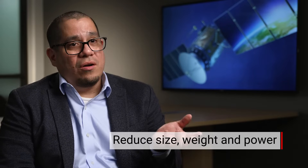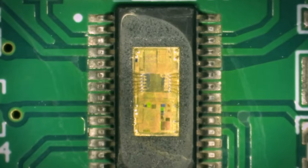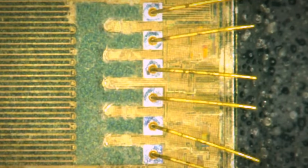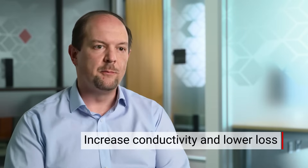Imagine you have your radiation-hardened die, which needs to withstand radiation effects in space, and now you're putting it through a very high reliability flow, but in plastic. We can reduce the size of plastic packages compared to ceramic by up to 50%, which means smaller bond wires inside the part itself. Those bond wires add to the resistance and inductance of the device, so by reducing resistance based on the bond wires in the part, we can actually improve the efficiency of the total solution.